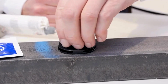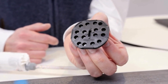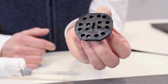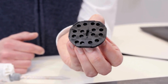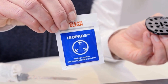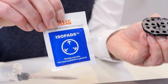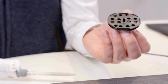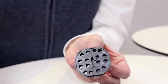This is a new adhesive mount that we have designed specifically for the wind industry. Before I'm going to put this mount onto this steel surface, I have to clean the surface with IPA, just to make sure there's no oil or any residues on top of this steel surface. I've done this before, so I'll just put it away and I'm going to apply adhesive onto the mount.